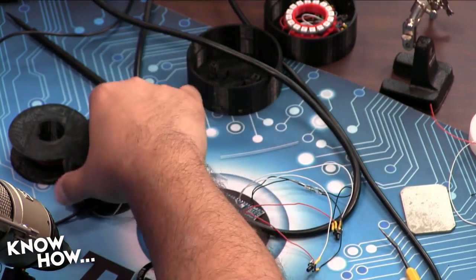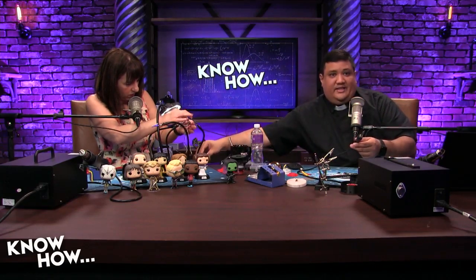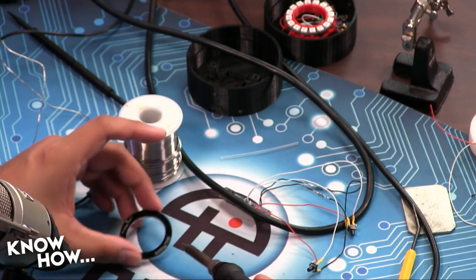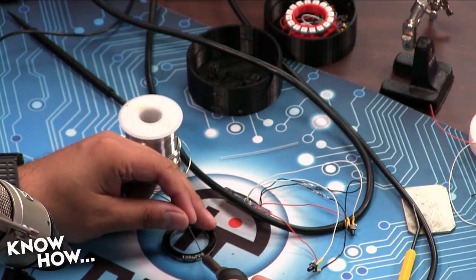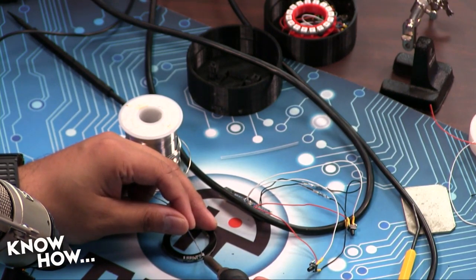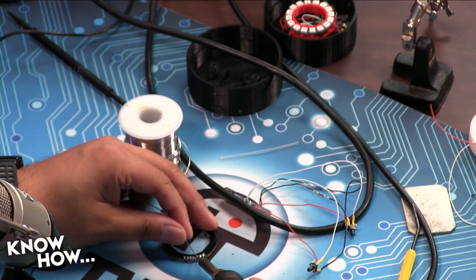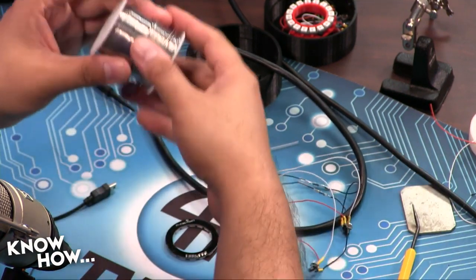All right, so when you're ready for your WS2812 ring, that's the wiring for you. And as we've done on a lot of these projects, I'm going to tin the pads first. It makes it easier for me to solder later on. So I want in, VCC, and ground. So that's what I'm going to do. Heat up the pad, not the solder. And then when the pad's hot enough, the solder will just flow. And you really don't need a lot. In fact, you don't want a lot on there. You just want enough so that when you attach the wire it will readily stick.